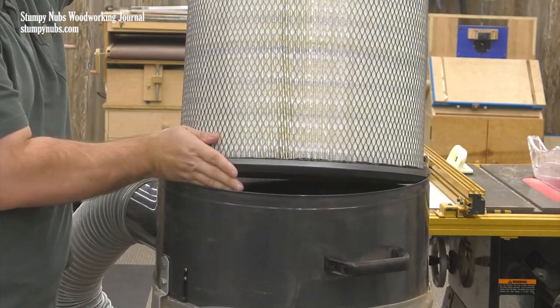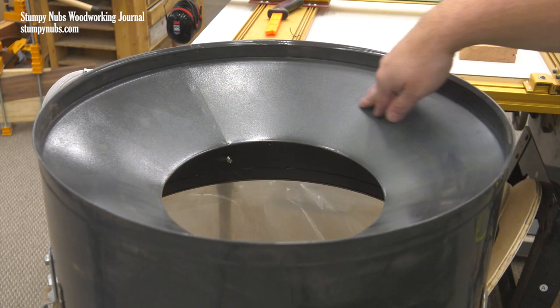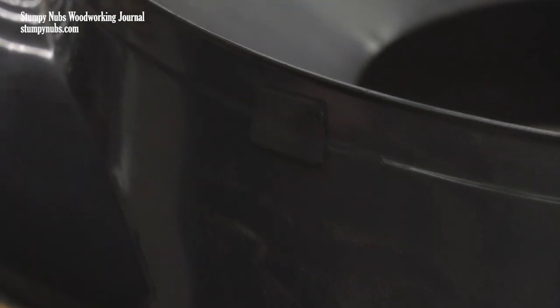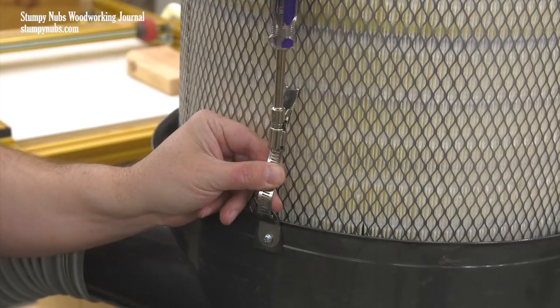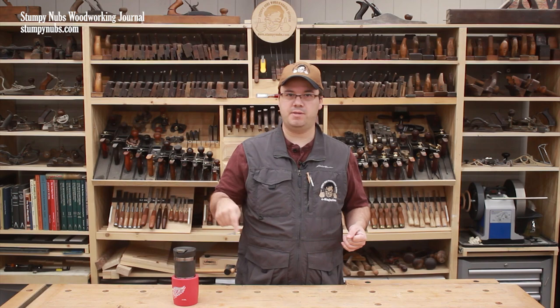The filter diameter is 17.5 inches, but unfortunately your dust collector's drum can be as small as 14 inches or as large as 24 inches. In the case of my central machinery collector, the rim is 19.25 inches across. This filter obviously won't sit on top of the rim, but this collector has a dust ramp inside, and my filter may be set on that ramp. The gasket on the underside of the filter will create a seal, but I need a way to secure it in place. This pack of hardware comes with the filter, and it includes little brackets that can be mounted to the metal drum with adhesive foam sealing strips on the outside and spring nuts on the inside. Also included are latches that draw the filter downward, securing it to the dust collector. Because there was only about an inch of space between my filter and the steel rim, the latches worked fine on my system.